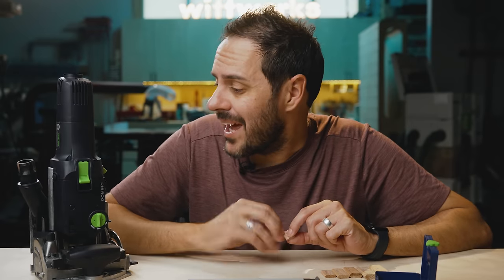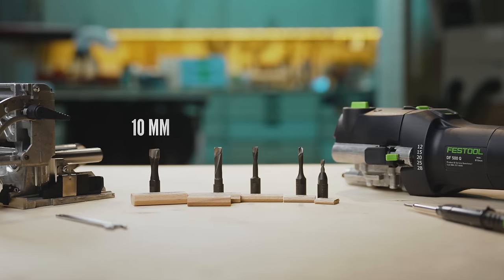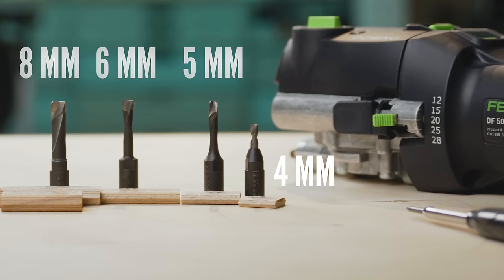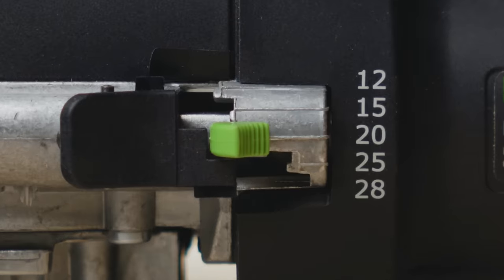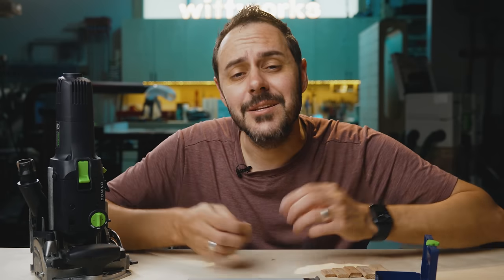After studying the 4x20, what I uncovered is that people get confused because you don't have a 10mm mortise depth setting — the lowest is 12mm. Here's where Festool is kind of brilliant: if you look at all the cutter heads — 10mm, 8mm, 6mm, 5mm — they're all the same height, except the 4mm, which is 10 millimeters shorter. So when you plunge with the 4mm cutter head, you go 10mm shorter than what's on the tool. All you need to remember: set the machine to 20mm depth. Because the 4mm cutter head being 10mm shorter means you've created a 10mm mortise.